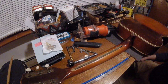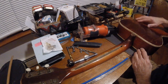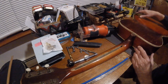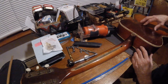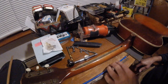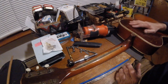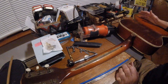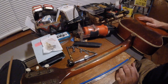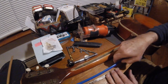A little background: I picked up this silver-tone guitar from the sixties. I'm pretty sure it's got a solid back and solid top, and I think it's birch — all birch — except for what I think is a rosewood fretboard. Anyway, it sounded really great but it really wasn't playable, only in one or two frets was it okay, because the neck was bowed. So I decided to put a truss rod in.